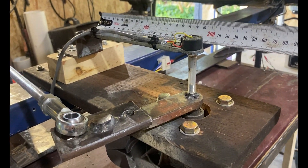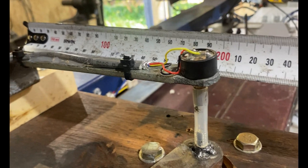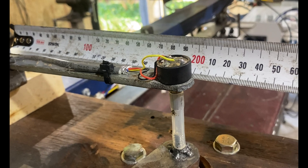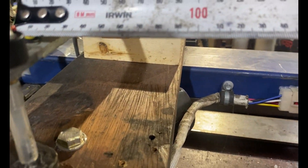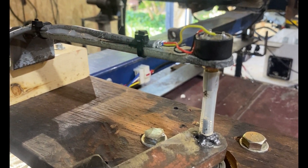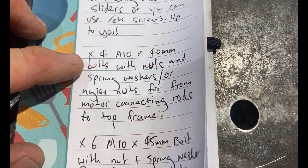You need a piece of flat steel if we don't have enough left from other materials. Get it from your hardware store's metal section or metal merchant when you're getting your other stuff. 210 millimeters in length would be ideal, anywhere from 25 to 30 millimeters wide. It can be two or three millimeters in thickness - it doesn't need to be five mil. That's what you'll need to run our traction loss potentiometer.